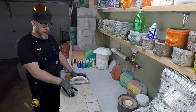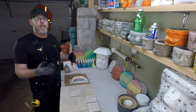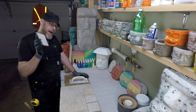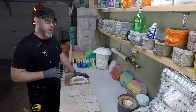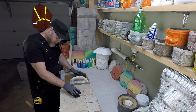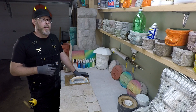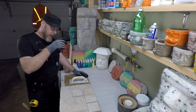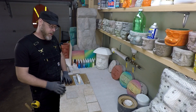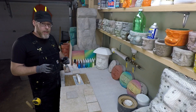When you remove 100% of the air between your tile and the surface you're setting on, it makes the tile so much stronger — it makes it part of the substrate. Any force it deals with gets absorbed differently. Remember that soup can? If the tile was installed poorly — just a big blob of thinset squished into place — you probably got out most of the air, but there's still some left. As a result, forces don't transfer the same way, and when the soup can fell and landed on the tile, it broke. But if you'd used a properly sized notched trowel with no air left in the finished thinset, it would have transferred those forces and likely not broken.